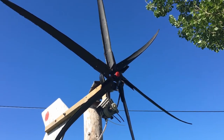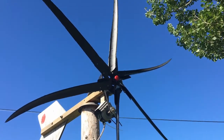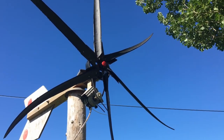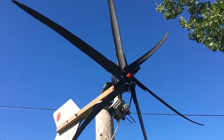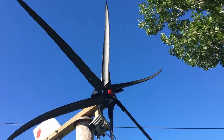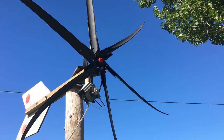You should use a bigger pipe with a bigger diameter, because these are quite thin and need a lot of wind to spin consistently, which in some cases is good because out here we got a lot of wind. It's an island. It's almost always windy, but almost always not windy enough to drive this at a constant 13.6 volt power output, so we don't have enough power all the time. And you see, also one problem with these thin blades is that it struggles to start up, so that would be much better with thicker blades.